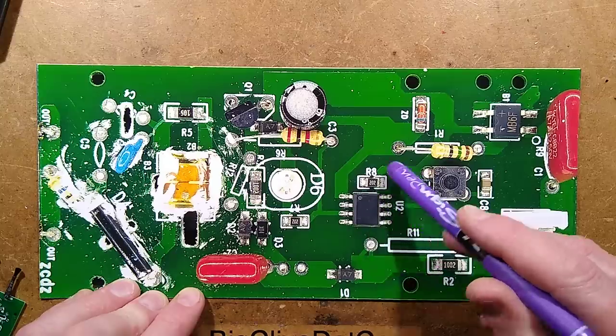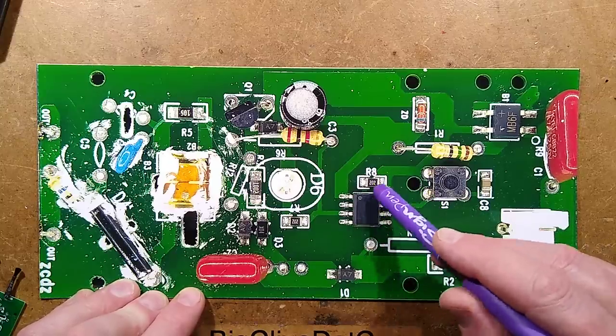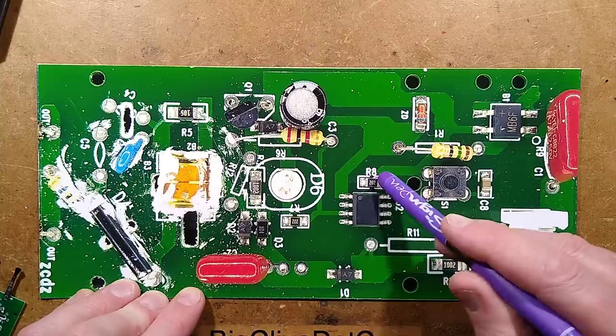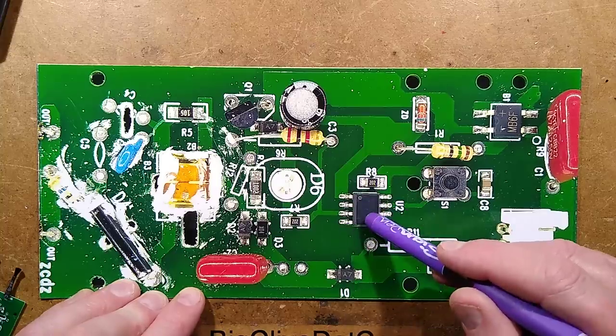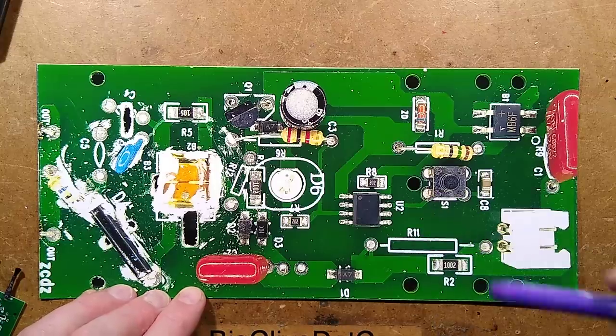The other thing associated with the microcontroller, it's only using two pins. It's three pins if you consider that there's a 2K resistor here just pulling pin 4 to the negative rail. That's presumably, well, that's very PIC12-ish because that's the pin that's used for the programming voltage.